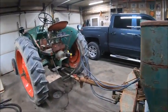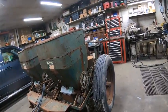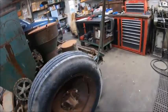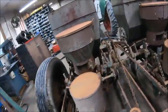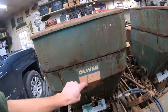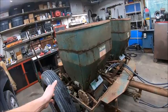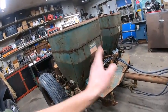That one has the older style decals which would put it in the Fleetline era and the wheels were red. This one — when I was backing it in here I saw that one of these wheels still has green paint on it. The brochure I found shows it behind a Super 77 or Super 88 — all it shows is from the rear wheel back. But the brochure shows it behind a Super series, and this style of Oliver shield is Super series. Green wheels would put this somewhere between late 1954 to early 1956.